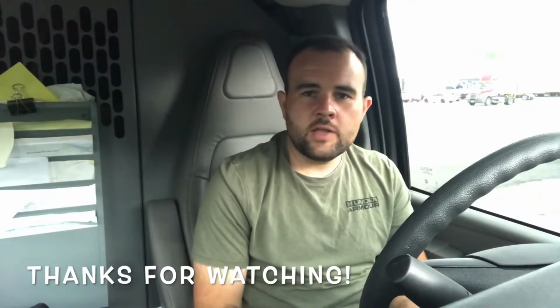So that's all I've got for you today. You can see how much of a hassle it is when they put these units inside, as opposed to just being up on a roof. We have to constantly come here and keep that filter media clean, so that the units don't have a problem and don't end up tripping out on a high pressure fault.